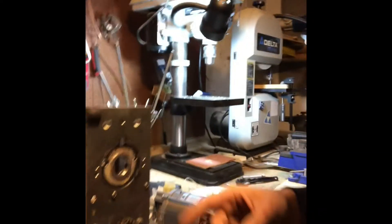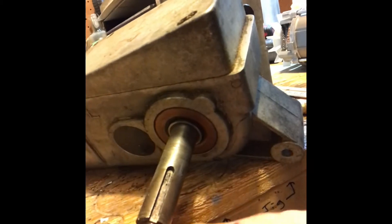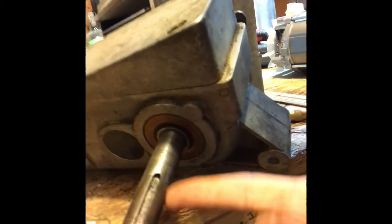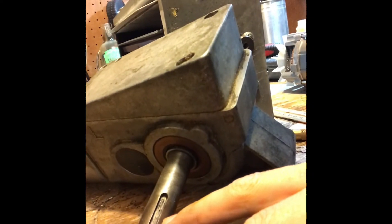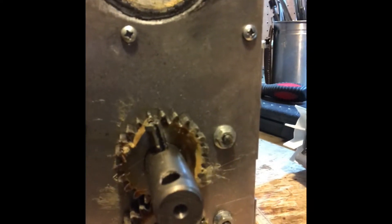What I'm trying to do is get this industrial shredder coupled to this wheelchair motor. It's geared and has a three-quarter inch shaft with a keyway, which is nice because I can put a set screw once I couple it to the shredder base. Unfortunately it's German-made and metric — the shaft here is 0.775 inches, so it's a little bit bigger.